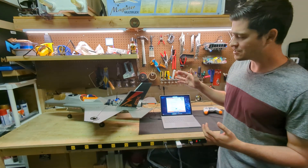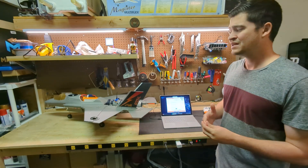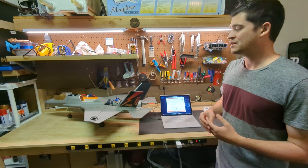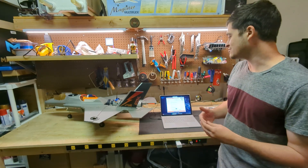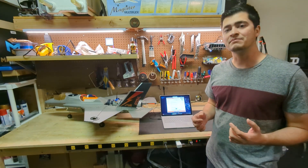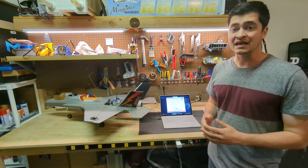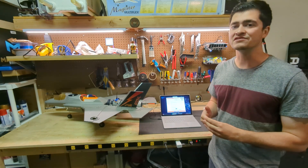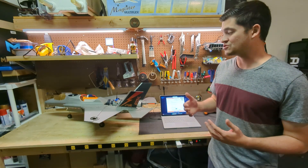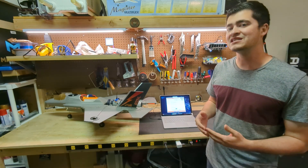What happens is if you power up the 3BSM control board without the servos plugged in or without battery power present, it'll try to perform that homing action but it can't because the servos don't exist, so it'll eventually time out so that you can still connect to the 3BSM control board and continue setup. The problem is that if you plug power back to the servos before disconnecting power from the 3BSM, it'll be sending regular motion commands as if it were normal operation after homing. Since those servos haven't been homed and if they start at a position that's not the straight position, they can run to the other end stop and damage themselves.